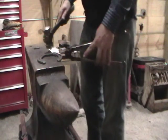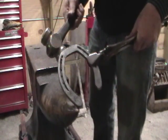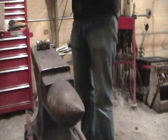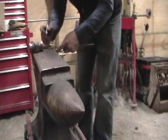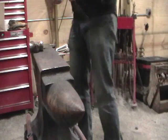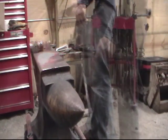We're going to nail. We've got our punched nail hole outside of the fullering right here, and we're going to go back and add a trailer over this long heel. What I've written for this shoe is three quarters of an inch. So we're going to start by turning over one inch and make a little mark on the anvil here where we can make sure we hit that point.